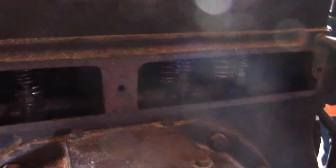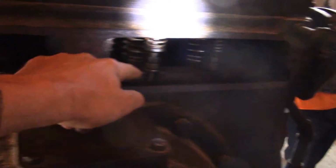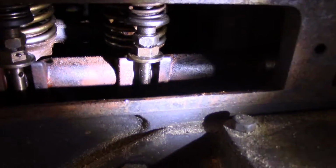Otherwise, remember, one of the cylinders, if it's going to take fuel, you'll be pumping it in there. And if you pump too much fuel in one cylinder, that can cause other startup issues. Yep. There's got to be a pressure relief up there on them. Yeah, there is, and a return line. But now, of course, that shuts it off by opening the valves. When you go this way, it actually lifts up all the valves.